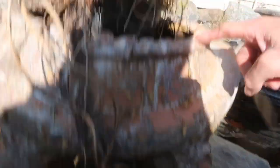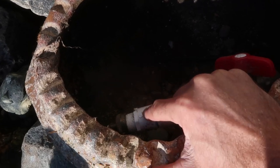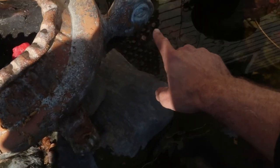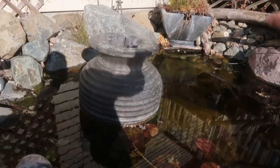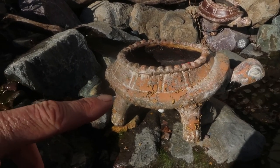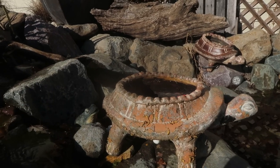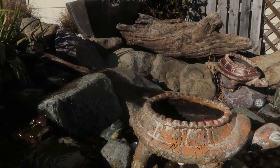We did turtle spitters - I got those dialed in. I piped it up, added a ball valve, and added a three-quarter inch threaded NPT autofill line adapter for the faucet. I ran the autofill line, drilled through the turtle head on both of these. Now off of our SLD 4-7 pump over in the pond vault, it feeds both patio ponds, the urn, and both spitters. I also noticed the foundation paint job on one turtle spitter is starting to split off in the weather, so this winter I'll probably bring that in, clean it up, and repaint it. The other one has a nice glazed finish and isn't having that problem at all.